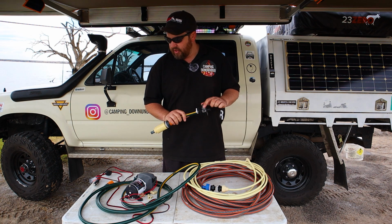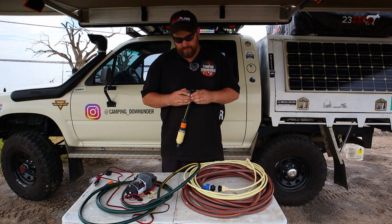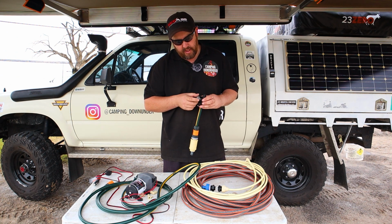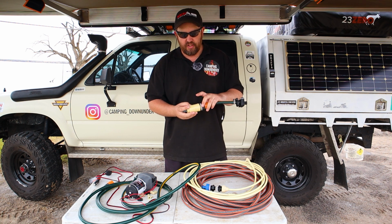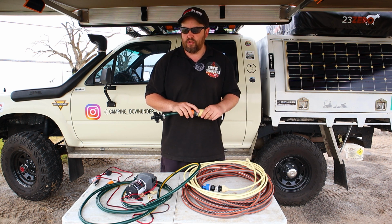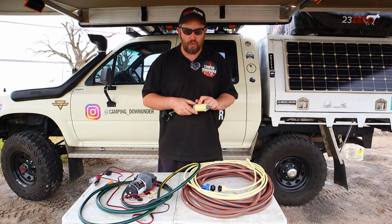the pump already comes with a little filter here. That was a built-in one. Trouble is though, that's a mesh filter and it's not the finest filter. So it'd be right for the bigger particles, but for the smaller stuff, I went out and purchased a second filter here, which is a misting filter. So that's finer, it'll stop all the finer particles and stop it from blocking up. And that's quite easy to clean as well.